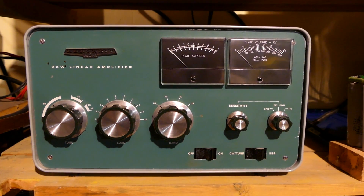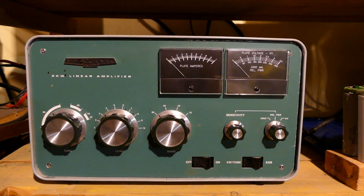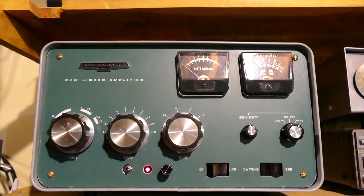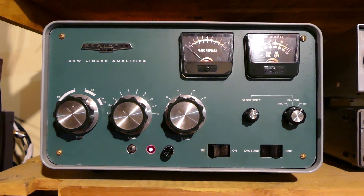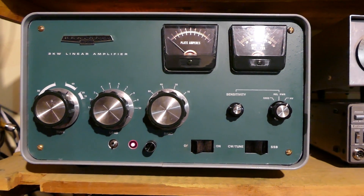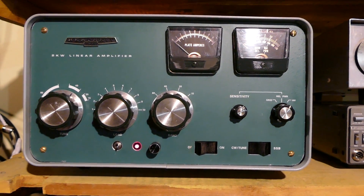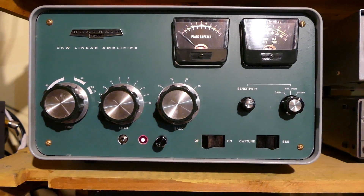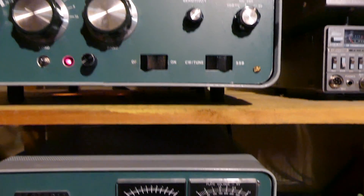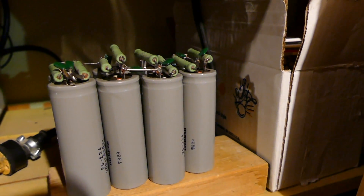So this amplifier was working. I felt quite comfortable after having repaired it that I knew what not to do in order to be safe. So I decided this project should begin. I opened the shelf unit up and began assessing what needed to be done — quite a bit of repair work was needed, with a long list of to-dos. Among the changes was replacing the 1978 vintage capacitor bank — the filter capacitors. This amplifier had these capacitors in it.